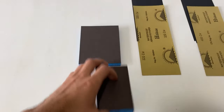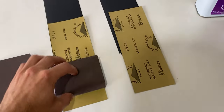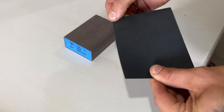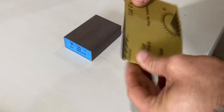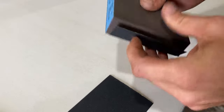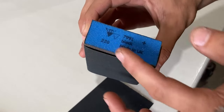I'm going to grab my 220 block, or you can grab your 320 or 400, wrap it around the block, and start sanding down the frame. I'll grab the 320, break it in half by folding it once, then fold it twice and rip it apart. Now I have two pieces — put it on the block, make a little crease, and on the other side you can use this as a sanding block. When you compress it a bit, it will also conform nicely to a radius.